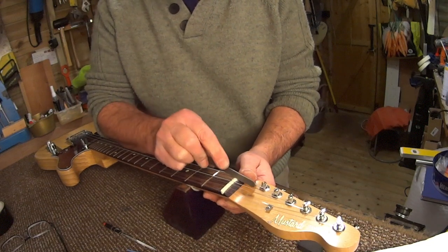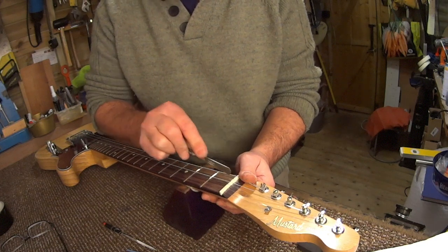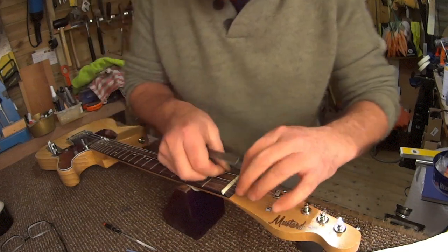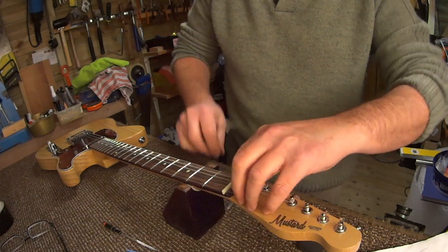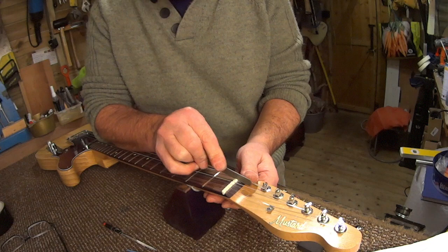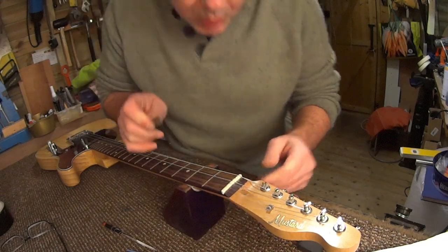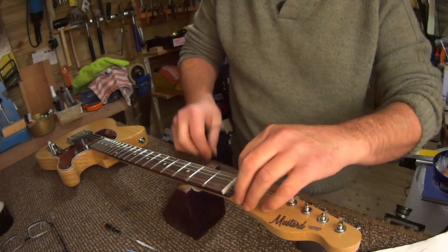It's no problem using a left-hander, considering that we're going to reshape it anyway, because most of it's surplus. Now sometimes you can get the blade starts to get held, and when you're doing these nut files, that's when you can risk overcutting, because you start really having to push the thing hard. So if you can, at all times, get it moving again as lightly as possible, that's the best thing for it.